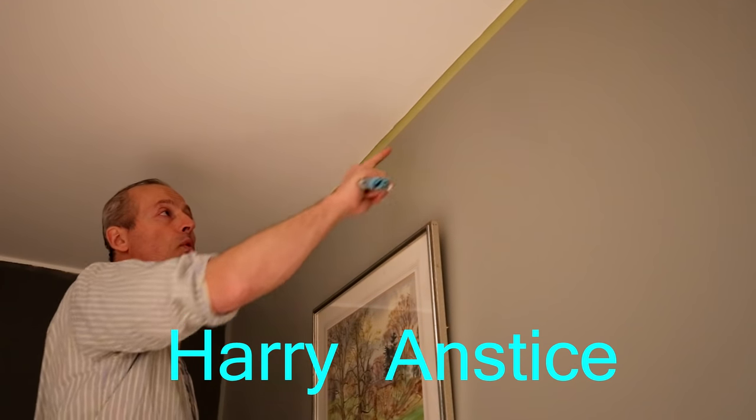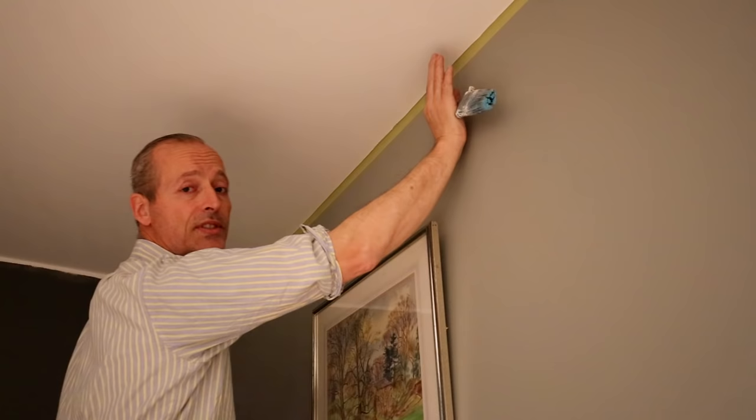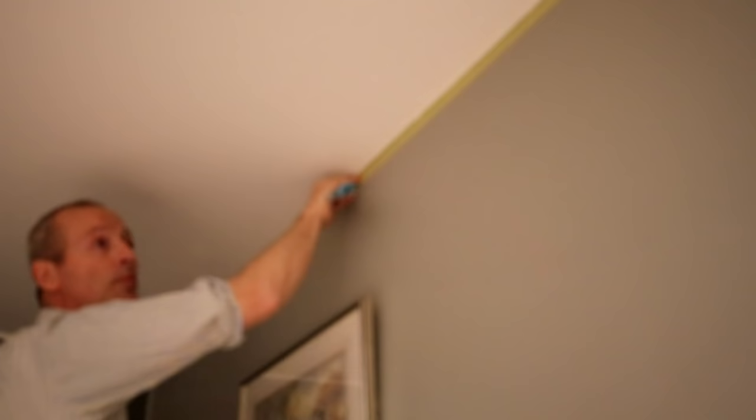When you're painting a wall up to the ceiling, it's very much the same principle as when you're painting the skirting. First of all, paint the wall and make it go a little bit up into the ceiling. As you can see, the paint is just creeping over the edge of the tape. Then apply the masking tape, which is quite obvious. I don't really need to show you that bit, but this is the next bit.